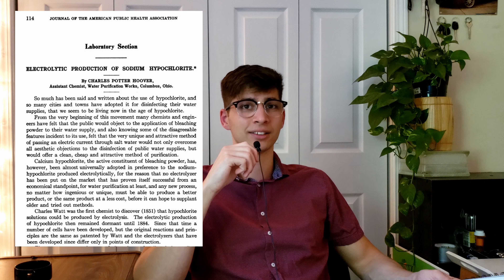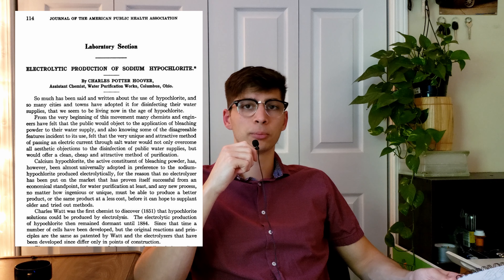The second source I looked at was an article published through the Journal of American Public Health, probably from the 1920s or 1930s — I'll link that in the description. They were trying to justify making bleach with electrolysis rather than traditional chemistry, and there were some good tidbits. At the time it was more expensive to use electrolysis, but they gave good details on the reactions going on. From that article I also found that a 10% salt solution was ideal, keeping the temperature down is really important because at around 60°C the bleach begins to decompose much faster, and there is a minimum voltage required to get this reaction to happen.